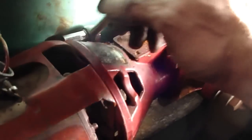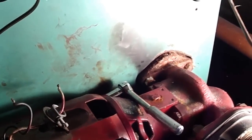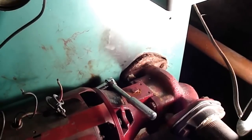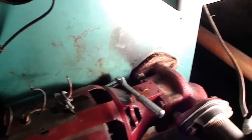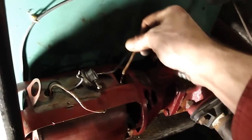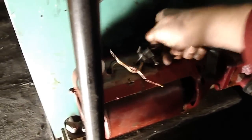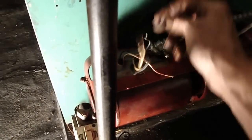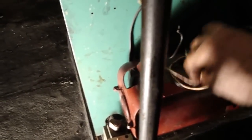We had to disconnect the electric here because it was hard to hold the motor up while it was still connected to this piece of wire. So we disconnected the electric to make it easier to handle the motor. Now we're going to reconnect it — it's very easy. There's a black and white wire and we're going to stick it through this little connector. This flexible conduit is called BX, and we're going to twist the two blacks together and the two whites together.